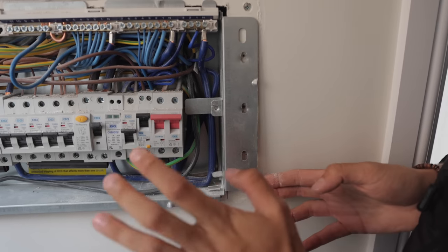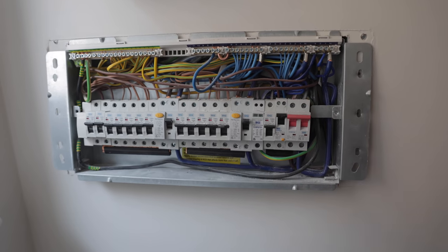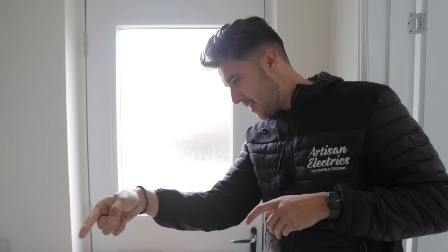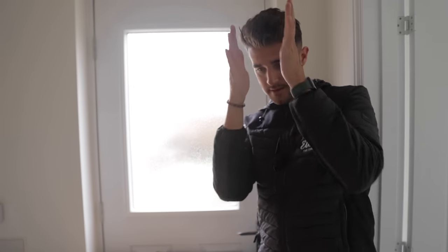I'm hoping I'll turn the power off before I get too carried away with this. I can take this board out of the wall. This is a lovely new build style board, and by lovely I mean complete and utter turd. And what I'm thinking for a route is that the duct is just the other side of that wall there. So what would be lovely in an ideal world is I'm going to drill a little hole in that bottom right corner there, put my magnet in there, my super rod magnet, take that board out, dangle the chain around, hopefully. Just because there's sockets and things there, I'm hoping that there's no in-between noggins, which I know is not going to happen, there's going to be noggins, but ideal world situation.